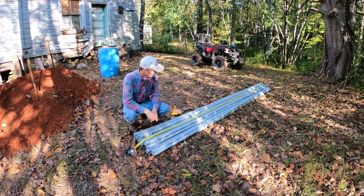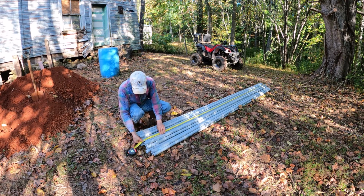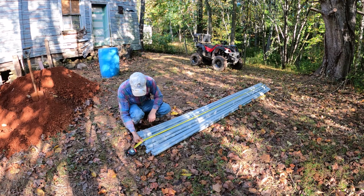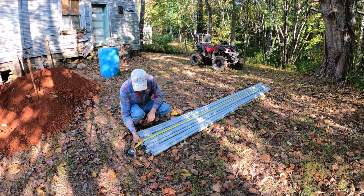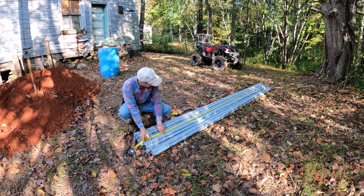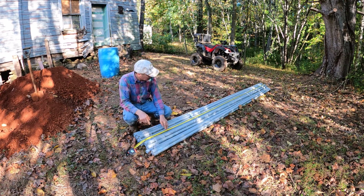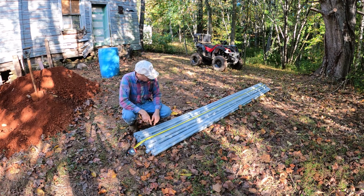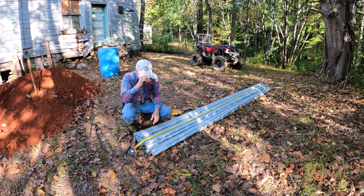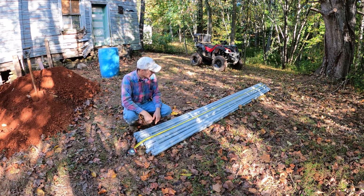It is the same thing with this conduit. It's 10 feet, and actually they're being a little generous here. It's got about an 1/8 inch or 3/16 over the 10 feet mark. The couplers are 2.5 inches, so we're losing 2.5 inches, and we have a length of 20 for the 200 feet. So we end up losing just over 4 feet just in the couplings.